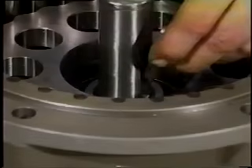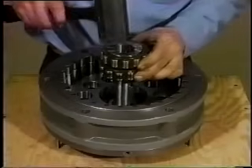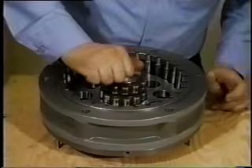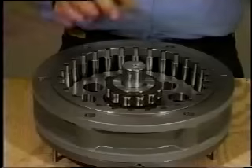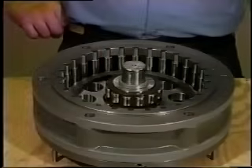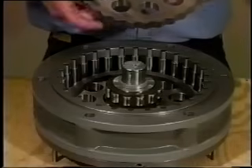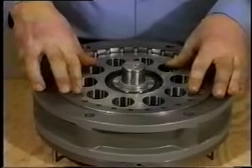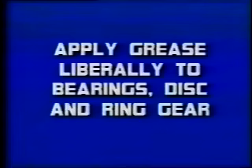Next, insert the bottom spacer and the key. Then insert the eccentric cam with the number up by tapping with a hard rubber mallet. You may have to rotate the high speed shaft to align the eccentric cam and the disc. Insert the top spacer and set the cycloidal disc spacer ring in place. Insert the top cycloidal disc so the number is 180 degrees opposed to the marking on the first disc — make sure the number faces up. Due to the close tolerances, the cycloidal disc must be completely square as it is dropped over the eccentric cam. For easier installation, slowly turn the high speed shaft as you're putting the cycloidal disc onto the cam. On grease lubricated units, you must liberally apply the proper grease to all bearings and to the cycloidal discs and the ring gear as you assemble the unit.